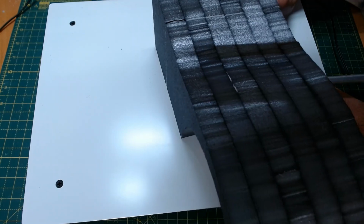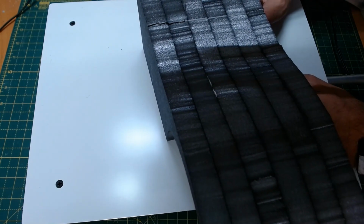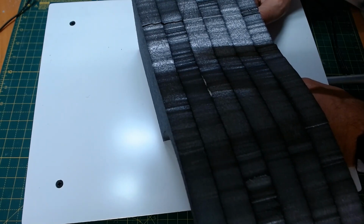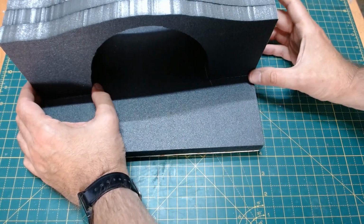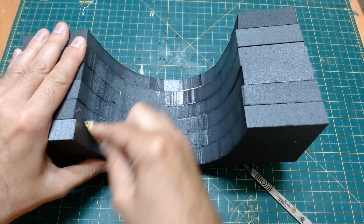And I noticed on the barrier between the slices where the Gorilla Glue resides, it takes the hot wire a lot more effort to get through. It is foam, so it can cope, but I'm very dubious about the fumes coming off the glue, so a mask is very important as well as good ventilation.